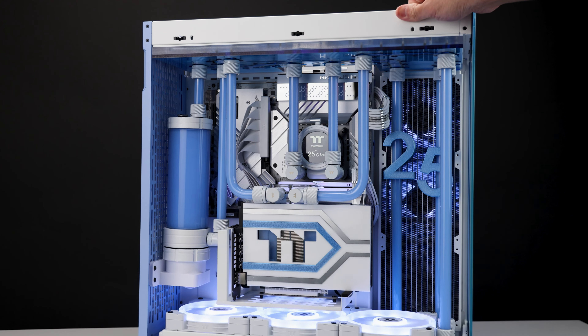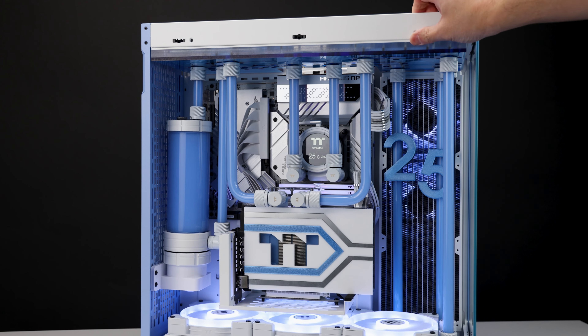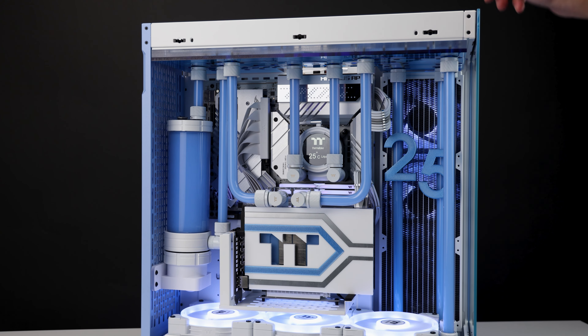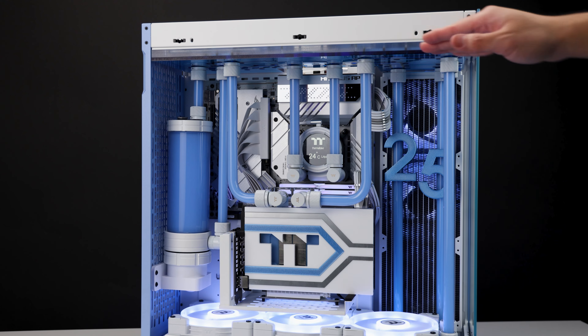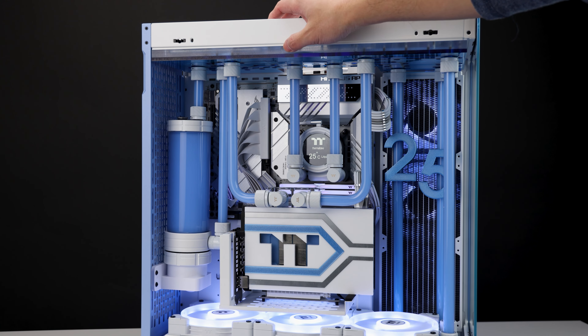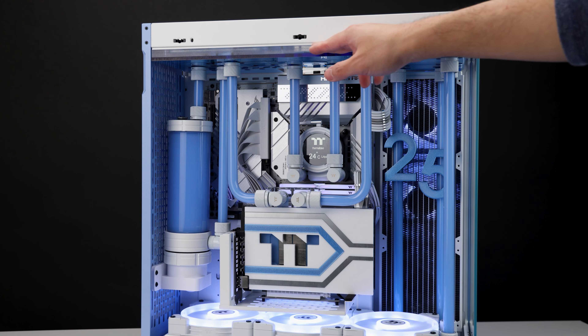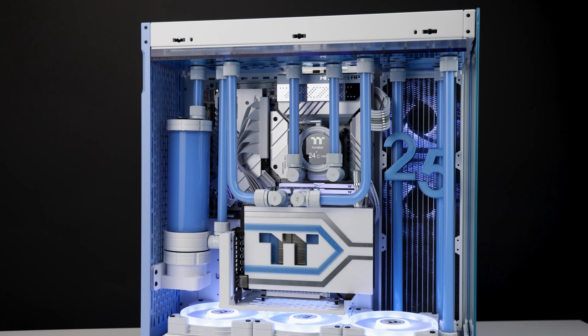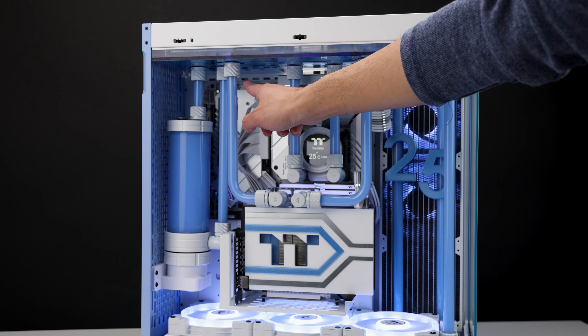I went with the distro on the top. The distro is actually multiple layers — this white layer kind of helps flatten the top because the top of this case is not flat; you have mounting points and everything. The top layer offsets that to make it flat, so I didn't have to grind the case down, sand it, repaint it, and rivet it back together — I just made the necessary adjustments by offsetting the ridges into the distro layers.